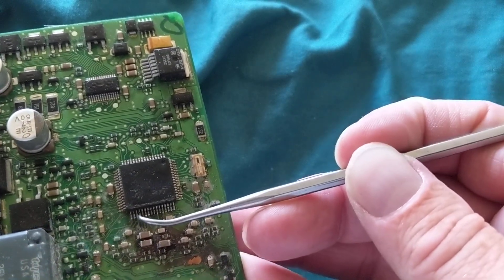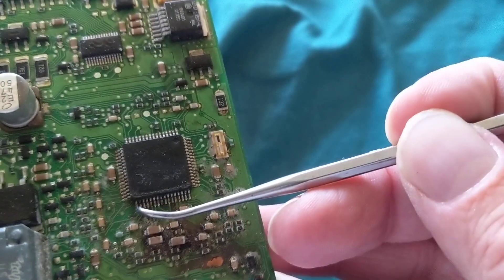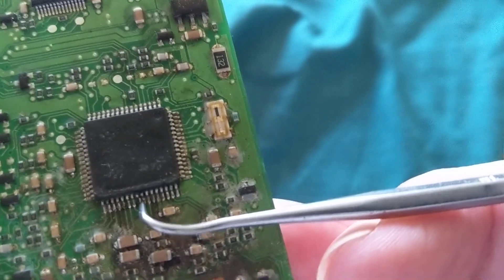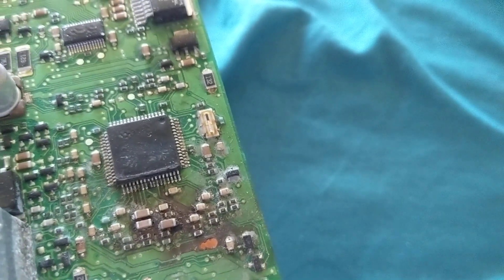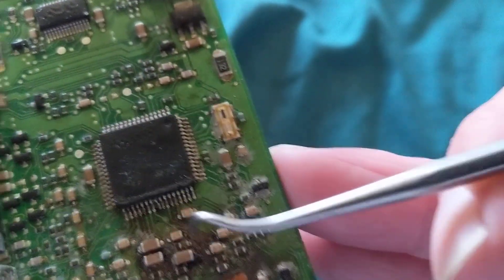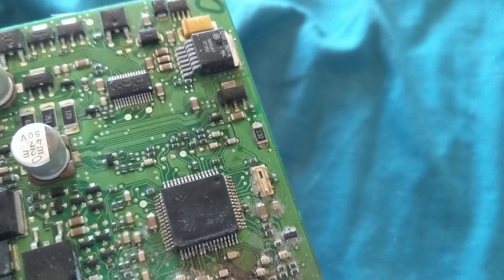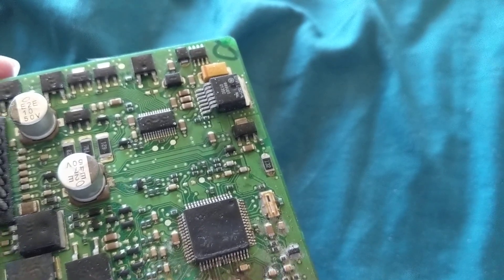As I explained, when these chips experience vibration, the pads can fail. I'm using a dental pick - an actual dental pick - going along all the pins. Anything that lifts up is a problem. See - this one moved off the pad. That means there's a bad connection. These chips, especially the four-sided ones with pins in the micron range, have a tendency for the pins to come off the pads. See, this one just came off. That's the problem with surface mount - you will not see this explained on any other channel.